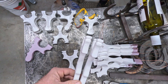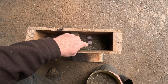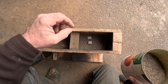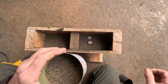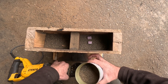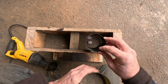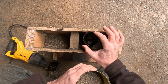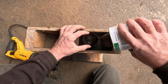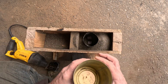I got two of them just buried in this box together — it's just dry loose sand. I trimmed them off kind of flush to the top of the sand. I vibrated it in with this reciprocating saw, which really settles the sand down and makes it pretty firm. Then I got this can to put over it and I'll fill around the can with some more sand to keep it in place and keep the aluminum from leaking out underneath.